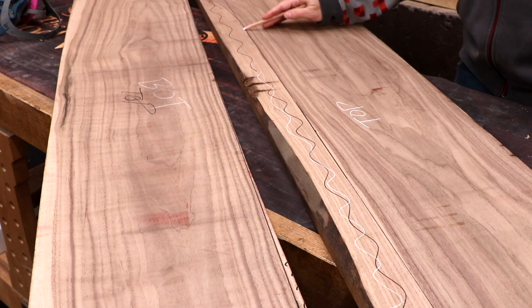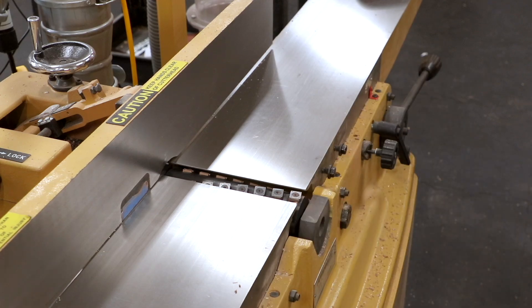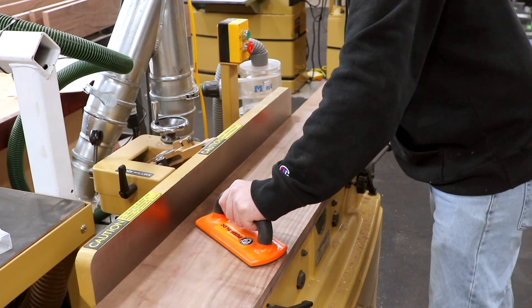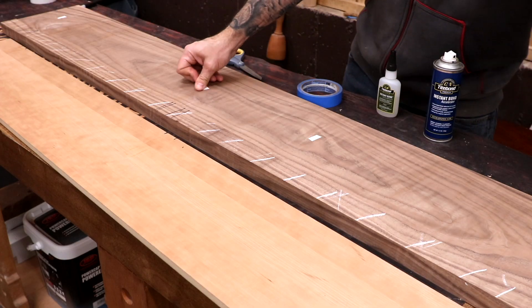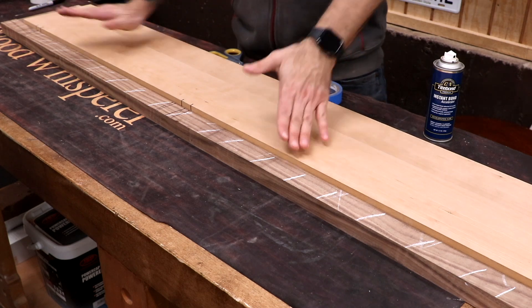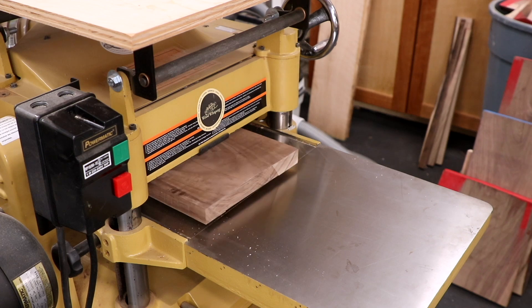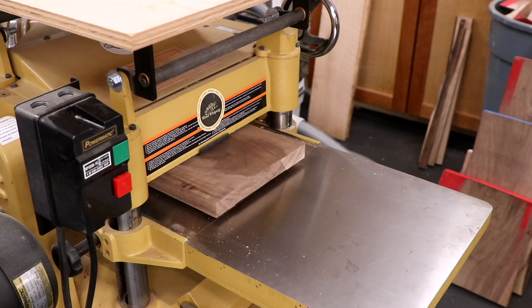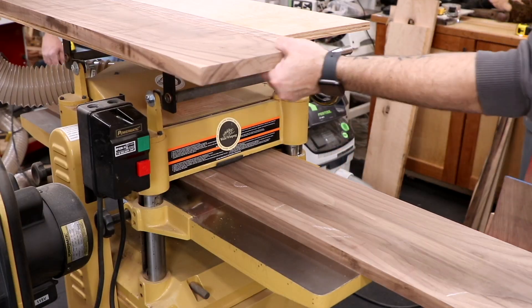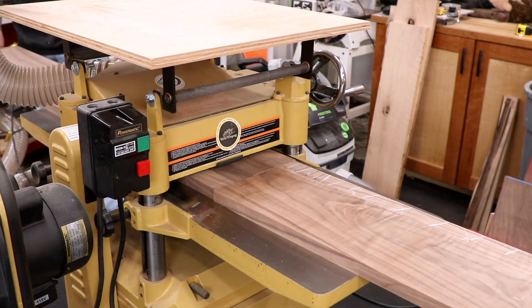These boards are more than eight inches wide and I really don't want to cut them down just to fit on my jointer, so I'll employ a little trick to keep the boards at full width. I'll temporarily remove the guard on the jointer, giving additional room for the excess to hang off the edge, and joint an eight-inch-wide section of the board so it's nice and flat. The board is then flipped over and using double-stick tape I attach a piece of scrap plywood about the same dimensions as the jointed area. With the ply pressed up against the little lip, we can head to the planer — with the plywood face down — to get a nice clean flat and parallel face. Then flip it over, remove the plywood, and send it back through the planer to clean up the remaining high material. While it's generally not a good idea to remove a safety device, this is one instance where I consider it justified — just be sure to replace that guard immediately when you're done.